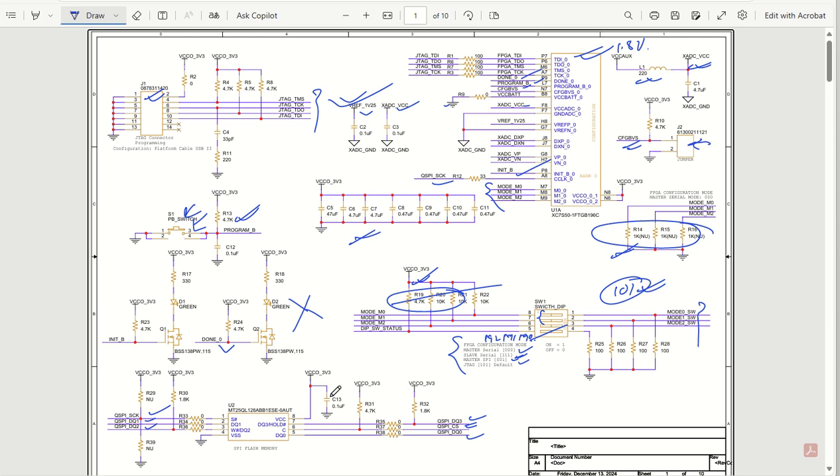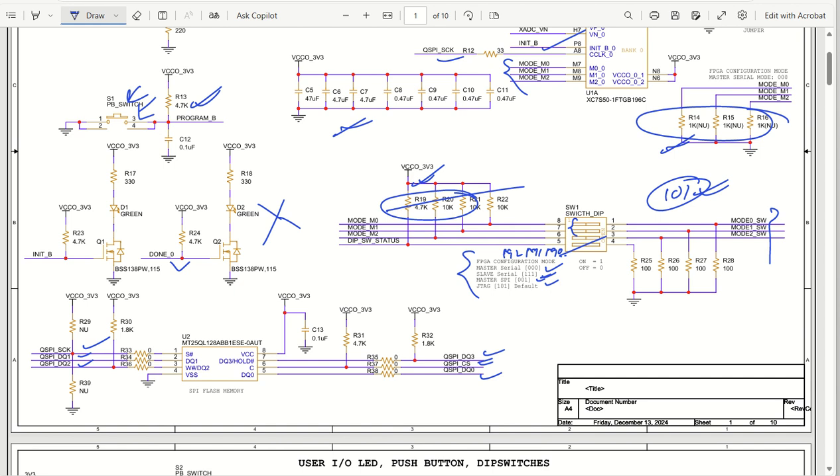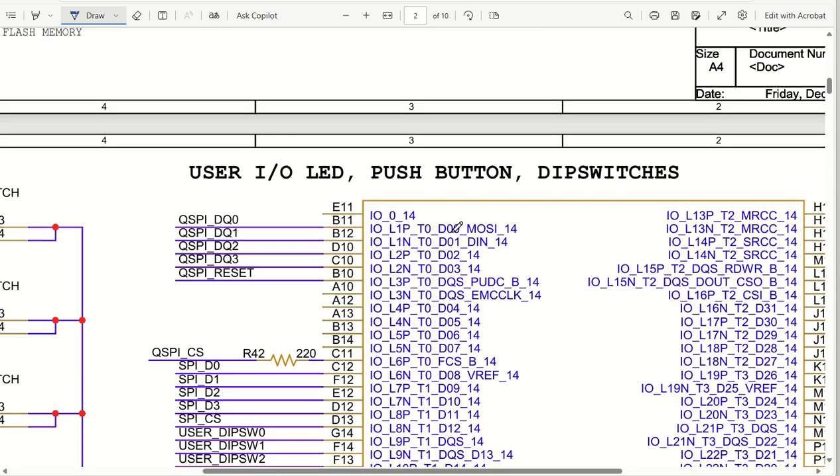If you have any questions regarding this configuration block, put them in the comment box and we will give you proper understanding on how to make changes. To finish up this configuration page: the QSPI signals have to be connected to the FPGA lines. For that we have used lines D0, D1, D2, D3 - so QSPI DQ0, DQ1, DQ2, DQ3 are all connected for configuration, and the chip select line has been connected as well.